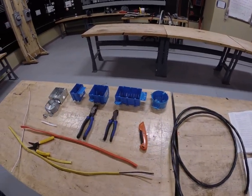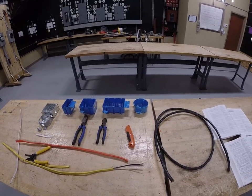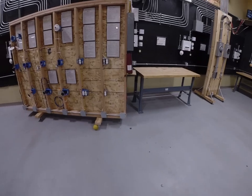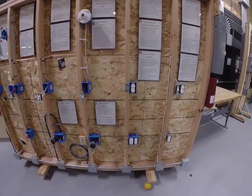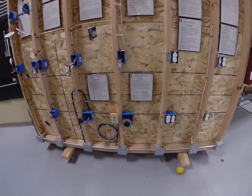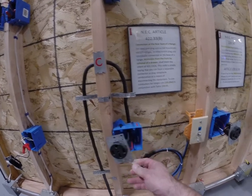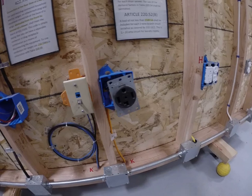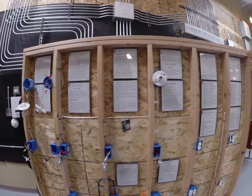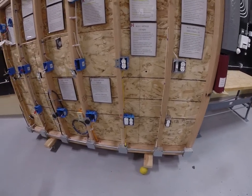So why are we talking so much about cable? You have to understand what NMB stands for — building cable. NMC stands for corrosion-resistant. NMS is no longer in the 2020 codebook, so I won't spend a lot of time on that. We're using this cable to do nice work residentially. Looking at my demonstration wall, you can see all of the uses of either 14-2, 14-3, 10-3, or 8-3. In general, we have a receptacle outlet, a dryer outlet with 10-gauge wire. There's a lot of code involved with residential wiring — anything that has a frame on this demonstration wall references the different codes that most inspectors would look for. Don't take residential wiring lightly because there actually is a lot of code involved.